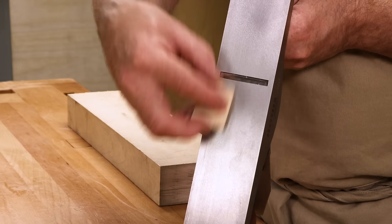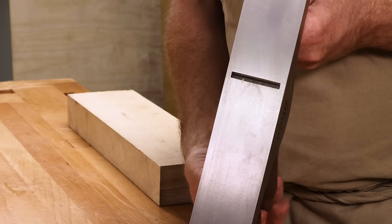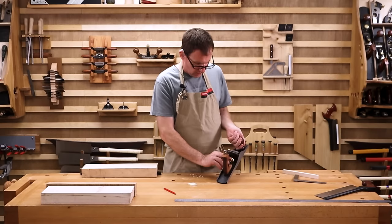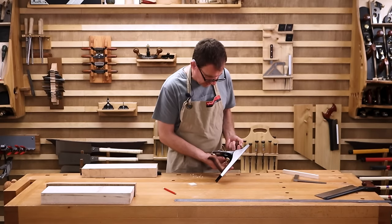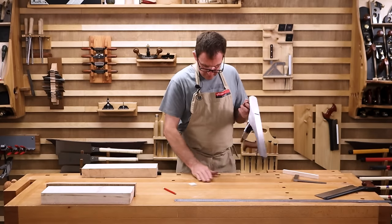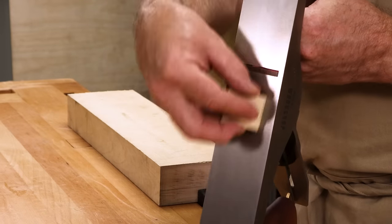That's better. So now we're more equal. Cut there, cut there. Okay, just a tiny bit now. How much cut are we taking? I reckon just a little bit too much, so I'm gonna wind it back just fractionally, then take up that backlash and get it back up. So hopefully our plane should be pretty good just below that cut edge.